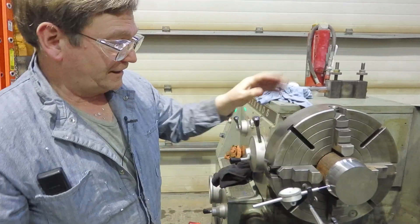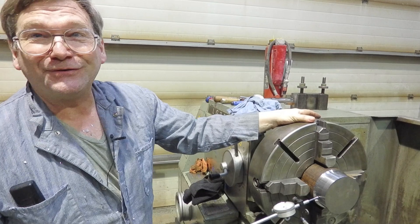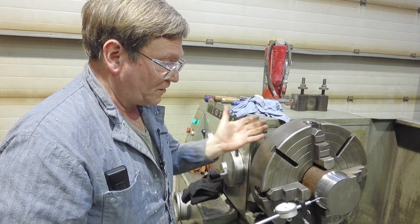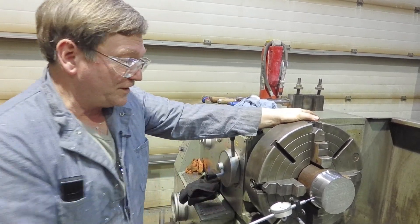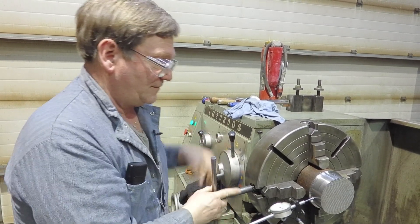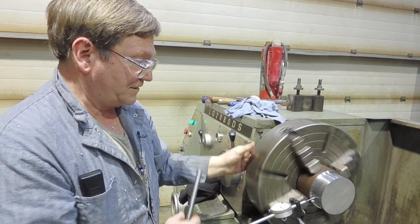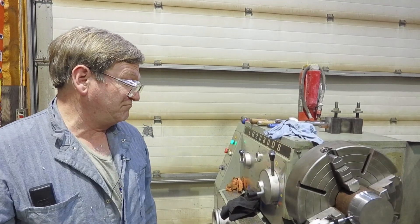You see how it wobbled when I let everything loose. So as you get in closer to actually getting it dialed in, you want to leave a little tension on your jaws. You don't want to let them totally get loose as you start getting close to your final adjustment. We're at 57, 62. So I'm going to tighten that one down to 60—that leaves a little bit of pressure. Getting close. I'm at 59 and 60 now. I go on the other side to get down to 61. The reason I went to 61 was because it was getting tight. So now I'll loosen it a little bit—not all the way—and now I'm at 59, but now it's sort of loose. I'm just barely over. If I bring this down an eighth of a thousandth, pretty close to 59 on both sides—come back to this one and we're pretty much dialed in. We could get it more accurate, but we're within half a thousandth.